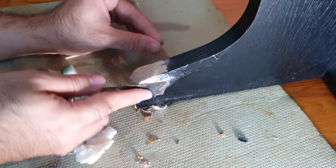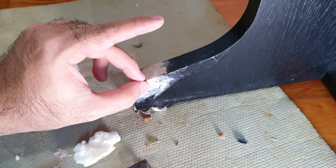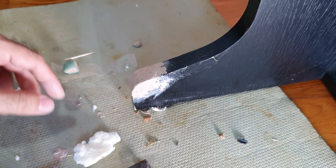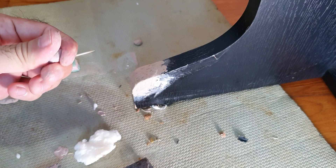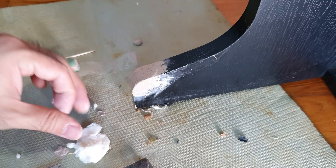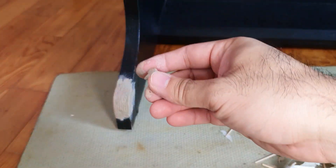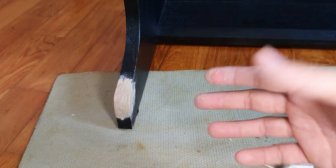There you go, and we'll just leave it as that. We'll come back in a bit. So, we'll leave the patchwork there and come back in about 10 minutes once that has hardened up. You do have your little ball that you saved previously — you want to check if it's done. Just give the ball a squeeze; if you could deform it, the epoxy is not really set up yet. Go and wash your hands and come back in a bit. It's been about 15 minutes already. I've got my little test piece here and you can feel it's rock hard. That's when you know it's ready to be painted.